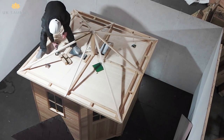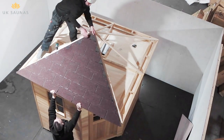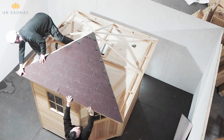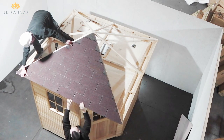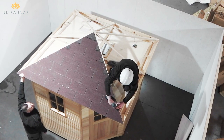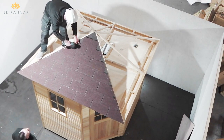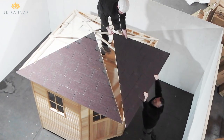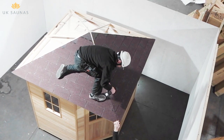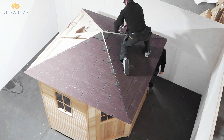You're now ready to start placing the shingled panels on the roof. These are split into quarter panels and you should ensure that the bottom edge is lined up nice, square and straight with the edge of the roof, and ensure that the other two sides sit nice and square on the joists or support beams that you've just installed. Once you're happy with the positioning of the panel, screw through the face of the panel and into the joist or support beam. This will later be covered by the corner shingle covers. You should use at least three screws along each support beam. Continue installing the quarter panels in the same manner until the roof is complete. Don't worry about any small gaps between the quarter panels because these will be covered up later. As long as the quarter panel is sat firmly on a joist or support and screwed into place, that's good enough.